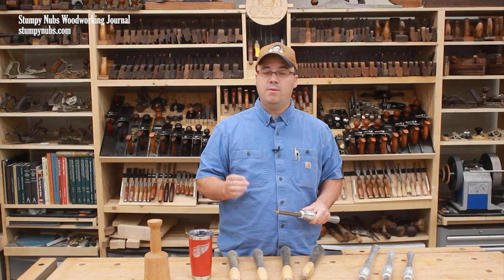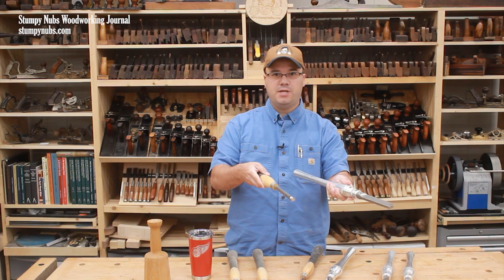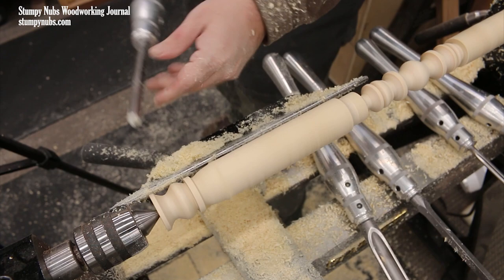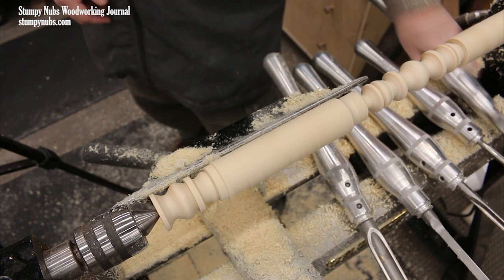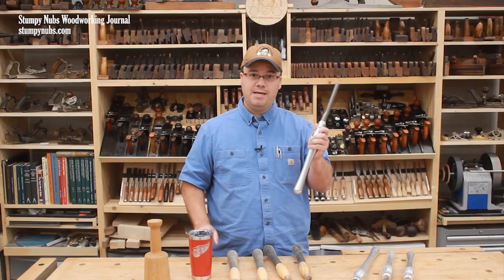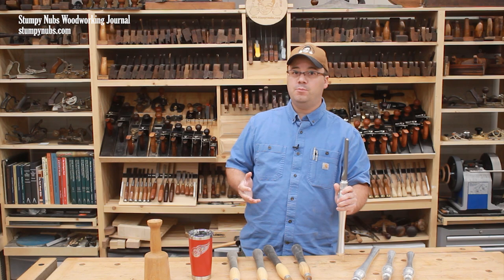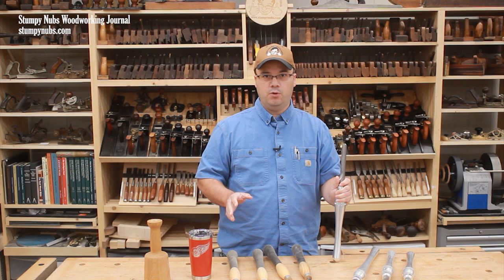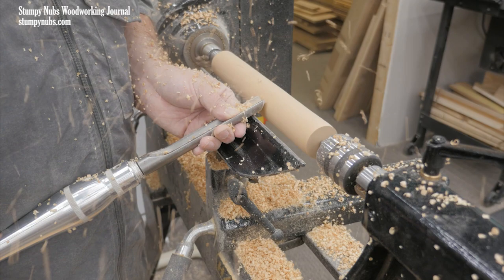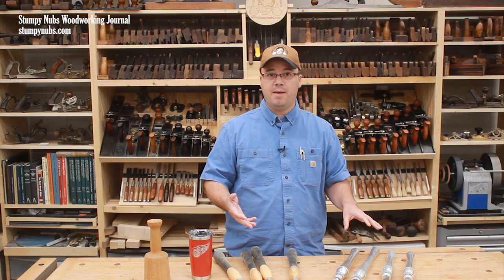Each may require a different technique. While a scraper may be held parallel to the floor, just like a carbide tool — because carbide tools are essentially scrapers — gouges and skews perform differently depending on how you hold them. You must learn how to ride the bevel, how to support the cut. You have to know the difference between roughing and shearing cuts and how to switch between them. There are a lot more techniques involved with traditional turning tools, and mistakes with these are much more likely to lead to a catch where the tool digs into the workpiece. Traditional tools also require some sharpening skills, and that's something that carbide turners can all but ignore. A beginner can eventually master all of this, but traditional tools do require more time, patience, and practice to master than carbide tools, which a lot of people can figure out in pretty much an afternoon.